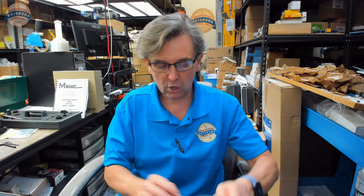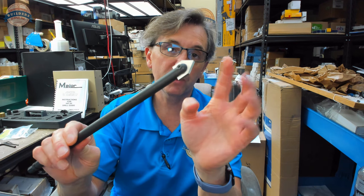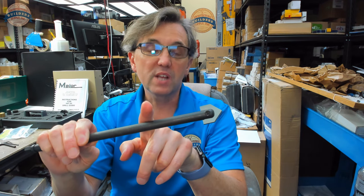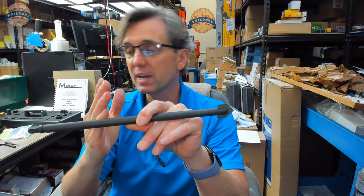Moving on through the installation instructions, the next section talks about the drill bits, the cutting tools that are included. It says the most popular bits used in the HIT 55, top to bottom. So they're showing an image of it. Drilling the edge of the door is going to be the 1-inch spade bit. You can buy that cutter on its own. You can sharpen that, obviously. Very typical and very common. A note is that if you're doing a 5-inch backset, this would be the only bit long enough to reach as far back as you need.